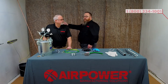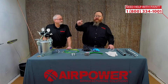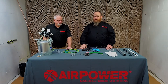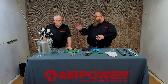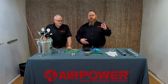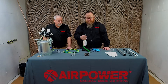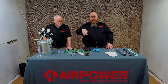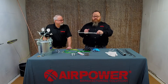People will say, how far do we need to drive the ground rod into the ground? As far as you can get it. If you can get it in with just enough on top to get a hook or clamp on to, you've done a great job. So you go from there to the wire and connector that goes to the rack holding the part. If that clamp — whatever style it is — is clamping onto the substrate or onto the rack and the rack has powder buildup on it, you've just killed your ground right there.